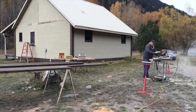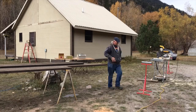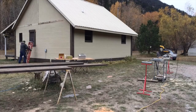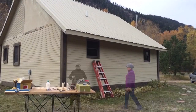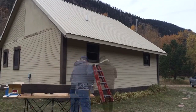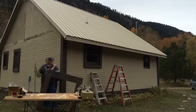Next comes the window trim. I did the windows two ways. The first one I did piece by piece, but I wasn't super happy with the way it was going together. It was difficult to get things pulled into place and get the miters right where the side pieces butt to the header. So I decided to preassemble. This made a tight fit on all of the joints of all of the windows — it was simpler to do and in my opinion they came out better. He built the casing to be a little bigger than the outside dimensions of the window frame, maybe an eighth of an inch all the way around. When I preassembled them, I biscuited and used pocket screws on the back side.